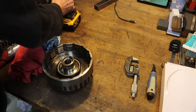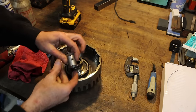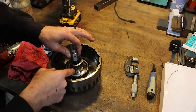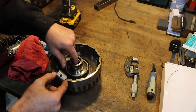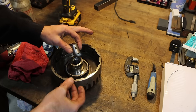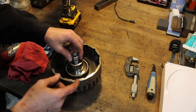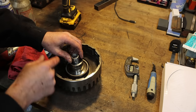So I just deburred the front of our hole there. There's a rough bushing. I'm going to press it in from this side, trying to make sure to line those holes up as good as I can. I'm going to wipe this bushing down really good and the bore, and put a little bit of retaining compound on both. Hopefully they press together and I'm satisfied with the way that it feels. Then this thing will go back in the lathe, get finish bored, and that'll be it. Be done.